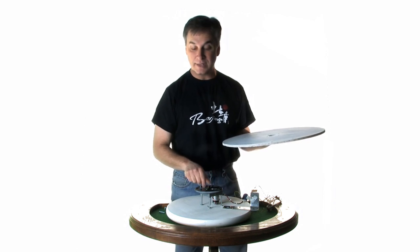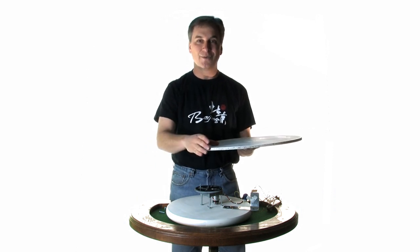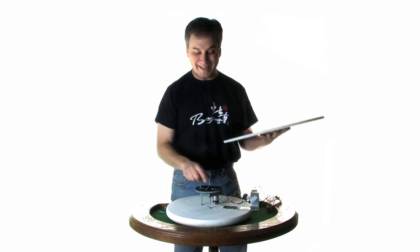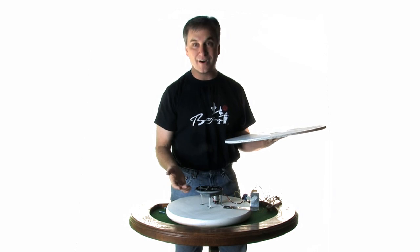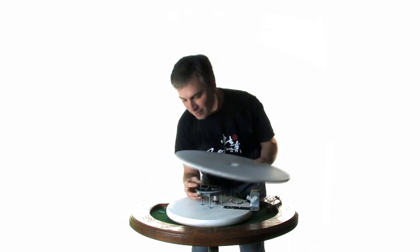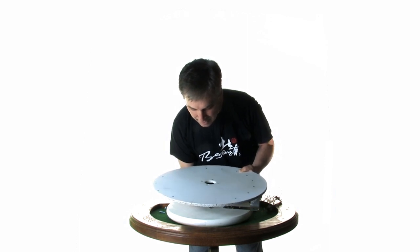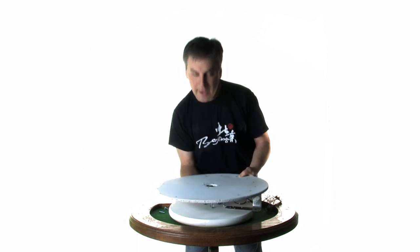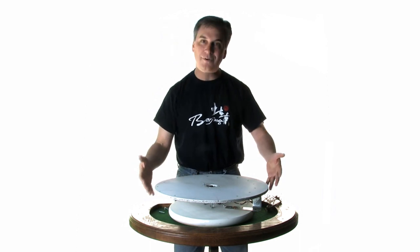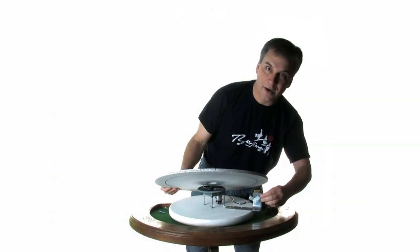The motor doesn't have to be DC — you could use a large AC motor if you wanted to. But keep in mind that depending on what you animate, there can be a lot of inertia, and once it's in motion this really needs a heavy axle and a strong motor. A wheel from a cart serves just about perfectly. The base that everything rests on is nothing more than a tabletop — they sell ready-made tabletops at Home Depot and Lowe's for only about $6 or $8. They're thick, made of pine. A coat of primer and you've got a beautiful wheel ready to turn.